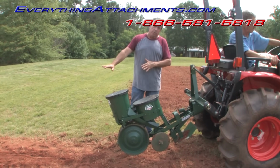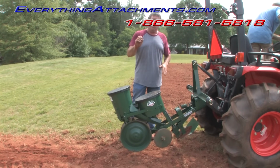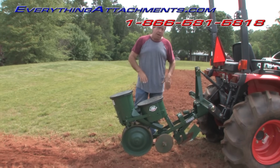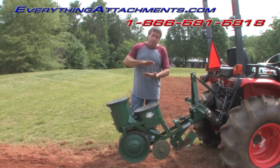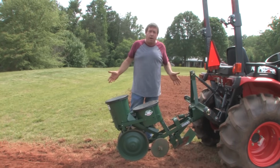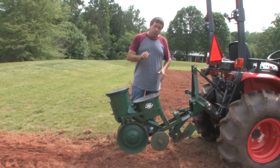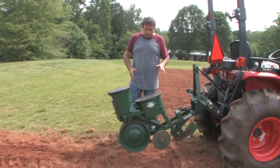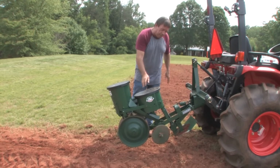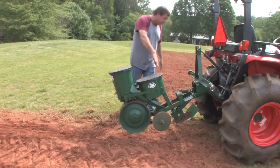It was able to go through there with the corn plate at first, even though the paint was in there, because the seeds are a lot bigger and they couldn't get under the plate to make it jam. But when you do something tight and that plate needs to really fit good, that paint that was in there, it may not be in all of them. This is the only one I've had assembled. But if you have that problem of this not wanting to turn, then it's most likely that there's paint gummed up in the very bottom of the tray where the seed tray works.